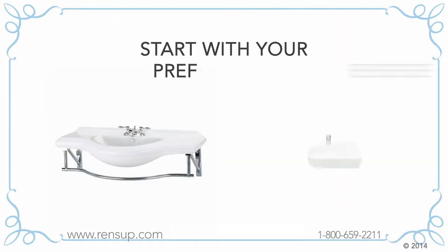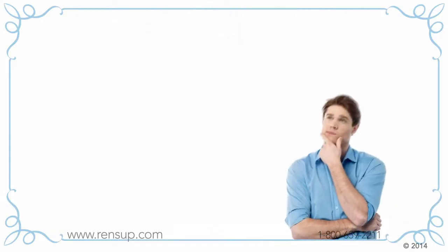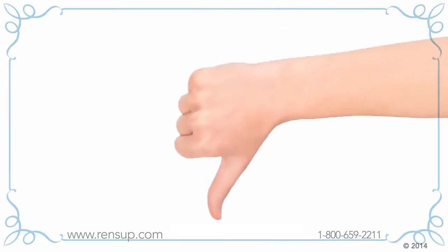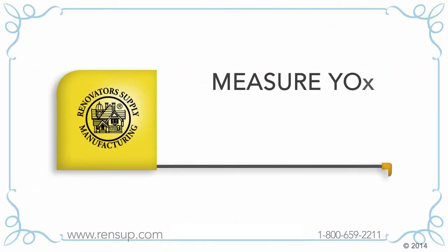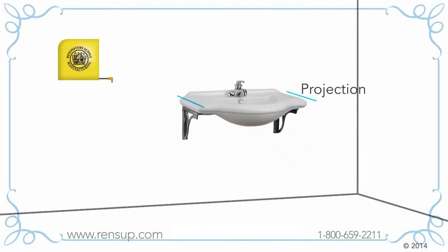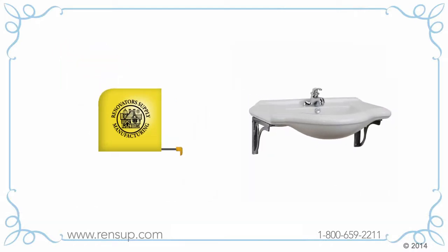Start with how big or small you want your sink to be. It's not uncommon for people to order a sink that turns out to be too big for their space. That's no fun. So take out your tape measure and measure the maximum space into which your sink will fit. Measure the width and then measure the projection, which is how far the sink projects from the wall. Write down these two numbers so you don't forget them.